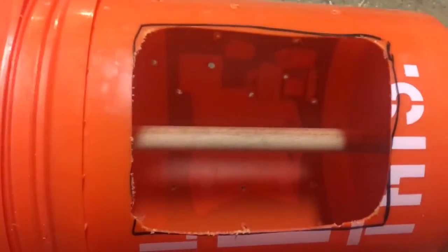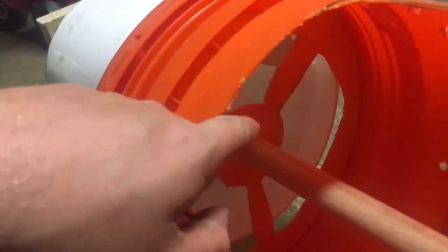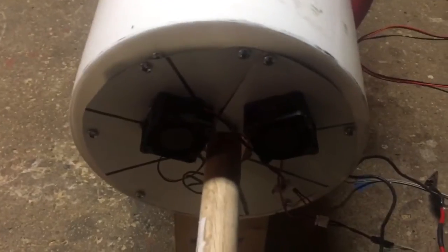So this is my dryer section. I will have a little door right here — it just opens and closes, I'll have a little latch. And as you can tell inside, I'm actually going to put a screen in there to block the clothes. This is where the heat comes from — this is my little heating chamber. Not very safe, I know, but it's still a concept. These are two DC computer fans; those blow air into the heating chamber. And here's my heating element — it's a ceramic one, it's 12 volts.